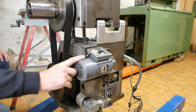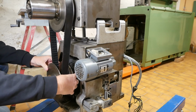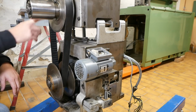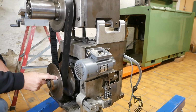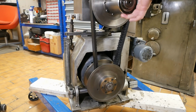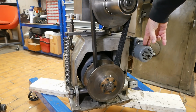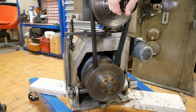Using this motor to adjust through this set of levers to push these sheaves together, you can reduce the amount of reduction and probably even reverse it so that that's turning this one at a higher speed than this one. Now you might be thinking that's a pretty darn complicated solution. Why did Schaublin go to all of this effort to put in all these mechanical components and a second three-phase motor just to change the output speed of the motor driving?